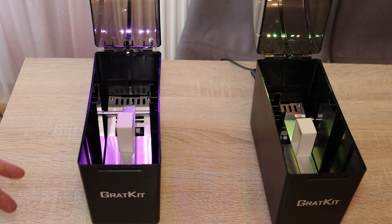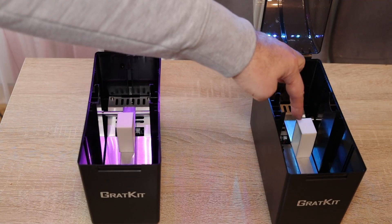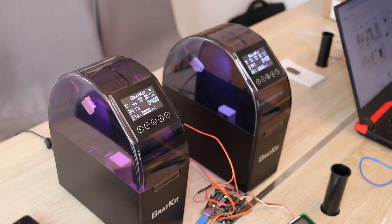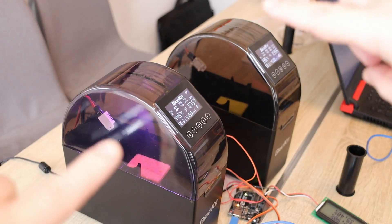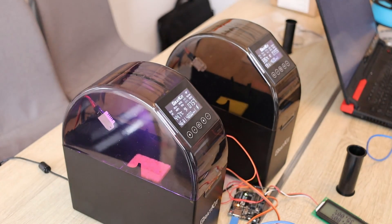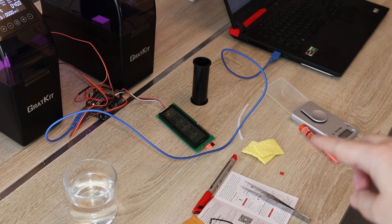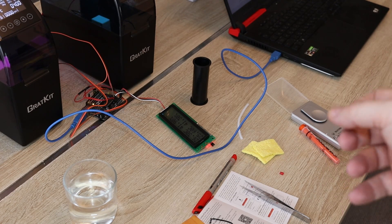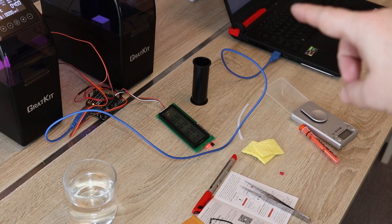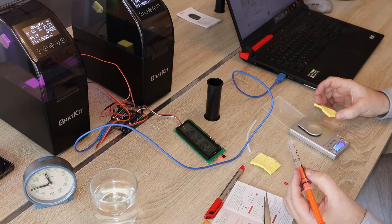It's time for my sponge test, where I will measure the temperature and humidity over the next one hour. The sponge will be placed almost in the center of the filament dryer. This is a DHT22 humidity and temperature sensor and I try to place them on the same location. I have to use the moisture exit because the cables couldn't go through the filament opening. I will add exactly 2 milliliters of water — measured by weight, much more accurate. I will collect everything with an Arduino Uno and analyze it in Excel.